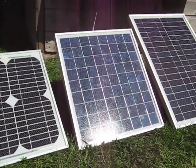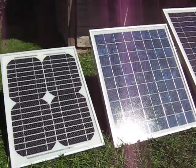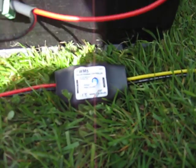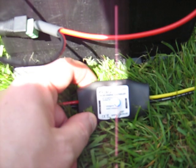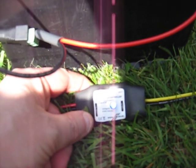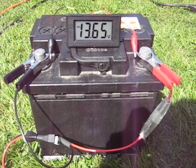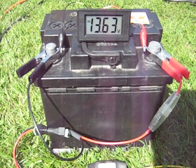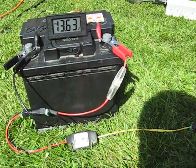This is my latest solar power setup. I've got three small solar panels here, and they're paralleled up in this connector here, and then they go into my PWM5 solar charge controller, which is pulse width modulating very nicely, and then I feed this battery, and that's sitting there at float voltage, 13.6 volts. So on the face of it, this is a nice green solar power setup.